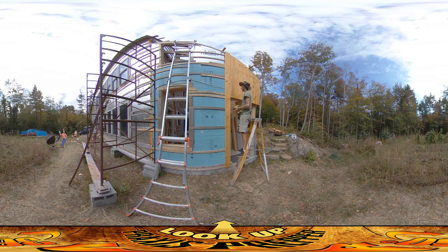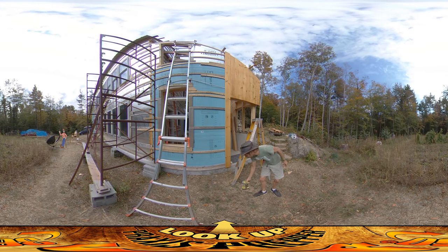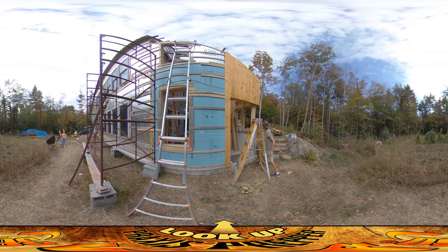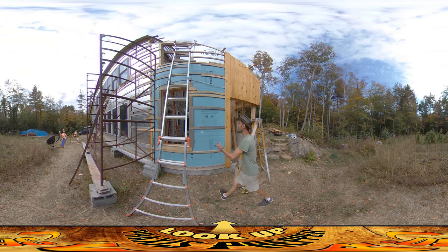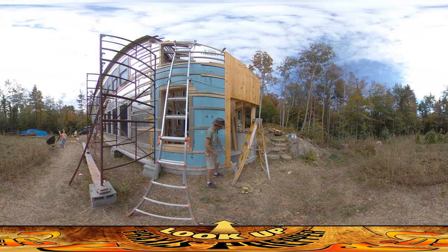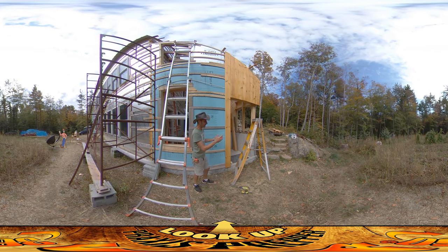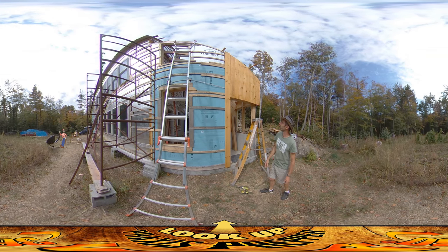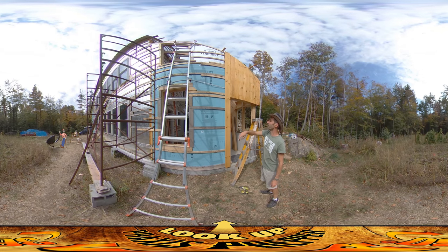At this point it's not going to fall off the wall. The next thing for me to do is to make sure it's nice and plumb. You notice there's a bit of a gap up at the top there — I need to get my level. I'm going to take my level, put it up on the side here, and make sure we're nice and plumb going down. This may have to swing out a little bit — I'll pull this and re-sink it there. I've got another board ready to go right next to it, and then it looks like at least another six boards that are going to be pretty easy until we have to start cutting around these windows.